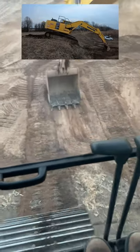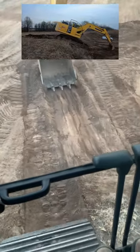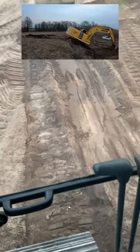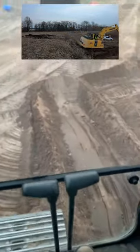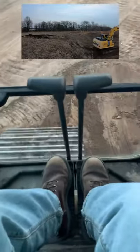I'm trying to do this one-handed, but then slowly bringing that boom and stick in to control the descent. Depending on what surface you're going down on, there's more or less concern about disturbing the ground. We're just in sand here, so it's not a big deal — but that's how to go down an incline.